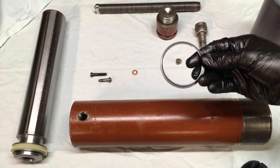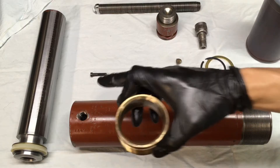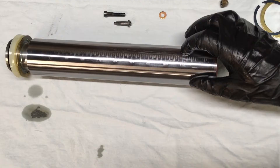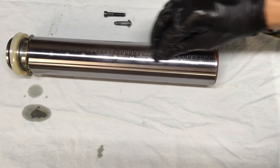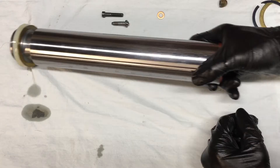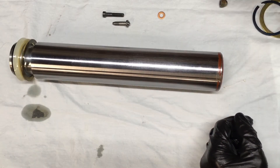I'm going to see if I can work this in here — I'm not sure if there's space for it, but looking at this retaining nut, I think I can make it work. Let's move on to how the spring assembly goes into the ram. You'll notice this ram has hardly any wear. It's not chrome plated, it's just bare machined and polished — probably 4140 or some alloy with a lot of chrome and shiny metal in it, with hardly any scoring. This cylinder was brand new and sitting in wax paper when I found it, but those seals just break down and fall to little crumbles.